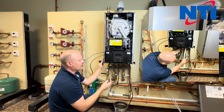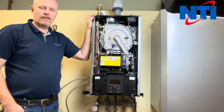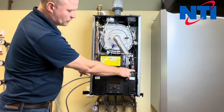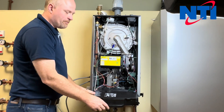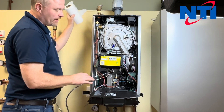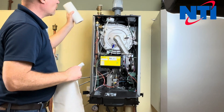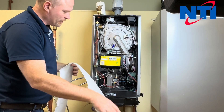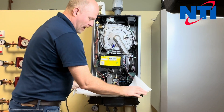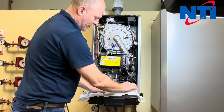I'm going to drain the boiler, and the next step will show you inside the boiler and how to disassemble it. Now that you have your boiler drained down, we're going to go inside and remove the flow and return groups. Open up the electronic cover. Make sure that this cover remains on the boiler, and it's a good idea to take some paper towel or some rags and just cover this up, because no matter what, there's always going to be a little bit of water left in these when you take it apart, and we want to try and avoid getting any unnecessary water into the electrical components.